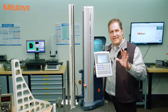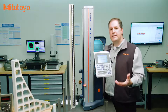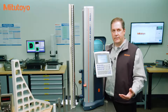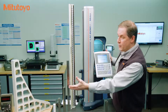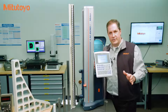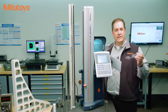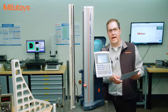In our experience there are five distinctly different activities that are often called calibration. Let's start with a review of the basic concept. In its simplest sense, calibration is about transferring some measurement units — like length in inches or millimeters — from some traceable measurement standard to another piece of measuring equipment. For example, this Mitutoyo checkmaster here — I could calibrate this using a comparison technique with these gauge blocks and transfer the traceable length from the gauge blocks to the checkmaster. Now let's get a little more official, as there are national and international standards that define the term calibration.